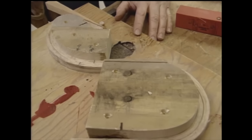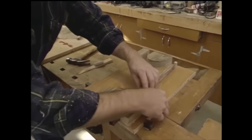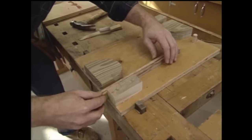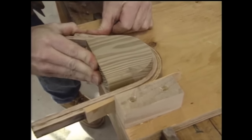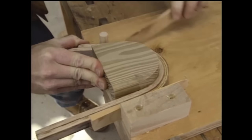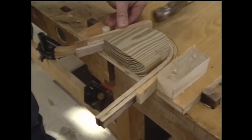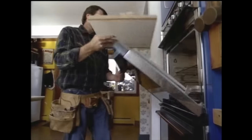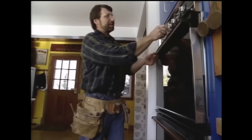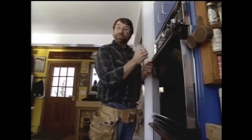Now using the same methods, I'll bend the hooks. I'm switching to a different form — this one is for the hooks. Here I just wedge the piece, bend it around the form, peg it, and drive it home with a wedge. Note that I'm bending two pieces at once because these are going to be glued together when they're dry, to give me the thickness that I want. To dry the pieces, I'm going to put the form and pieces in my oven, right about in the center. Set the temperature at about 150 degrees — the lowest setting — and bake. About six hours they should be done, or until the wedges get loose.